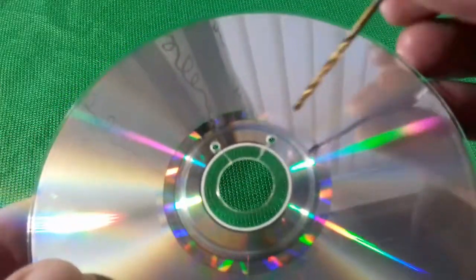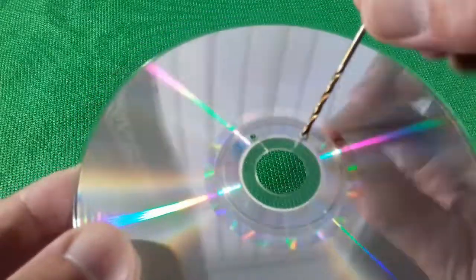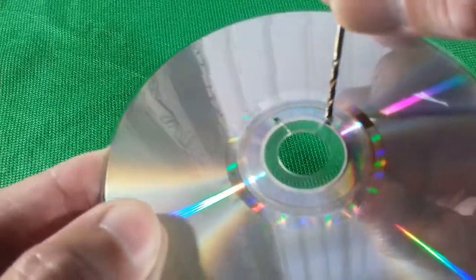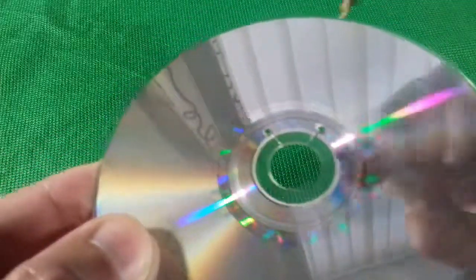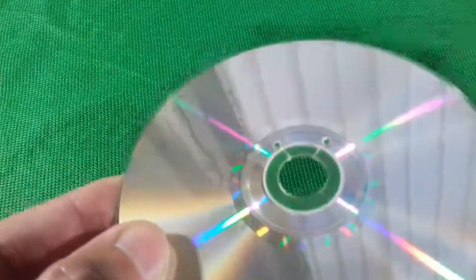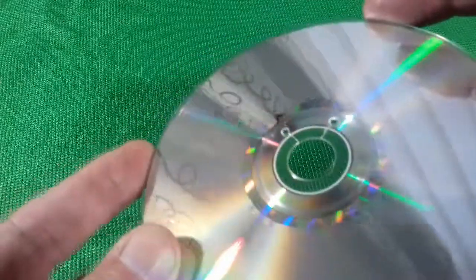As you can see I've now drilled the holes at the end of the cracks. I've used a 2mm drill for the purpose because I find it easier to line up with the end of the crack. And then I've used a slightly bigger drill just to take the burrs off the tops and bottoms of the holes so that it gets a nice flat surface to sit down onto the turntable.